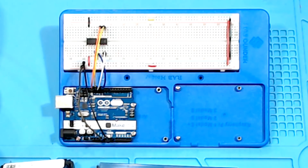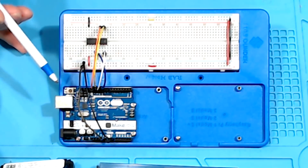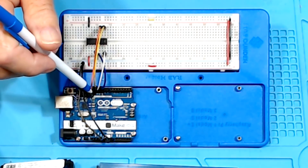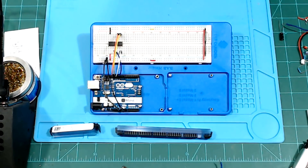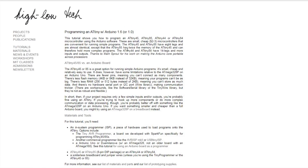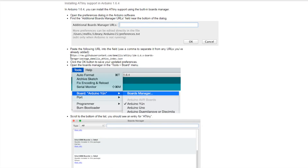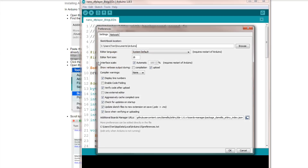Here I have it set up on the breadboard, and all it takes is six wires going to the Uno. You have the plus and minus, and then you have pins 10, 11, 12, and 13 on the Uno going to pins 4, 7, 8, and 9 on the ATtiny84. I'll show you how to set this up again as an ISP. Here's the high-low-tech.org page — you come down here and copy this URL and put that into your Additional Boards Manager URLs.